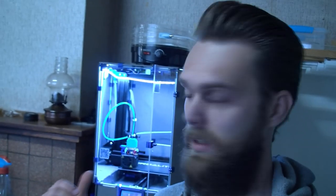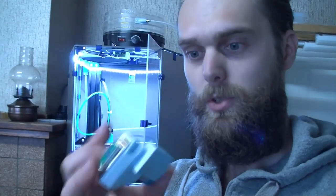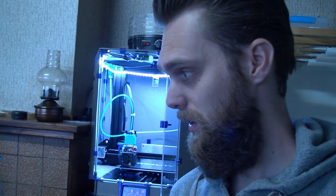I'm going to use the Ender 3 Pro for the PETG and PLA. I'm going to use the standard hot end it came with. I have already mounted it. And for the ABS and nylon, I'm going to use this E3D hot end. And I'm going to print the design made by Maker's Muse. Link in the description. That's it.